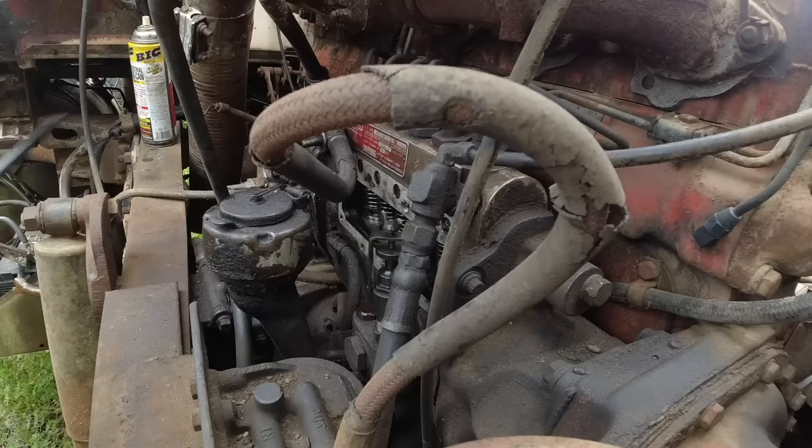The only thing about turning the pump, sometimes because of the cam and the lobes and the springs, if you turn the pump, you'll turn a little bit, and then it'll snap over a lobe and push you past your point. Yeah. I don't know how hard it is to roll the engine, but usually the engine you can fine-tune a little better. Yeah, we'll stick a socket on the crank or something and figure it out.